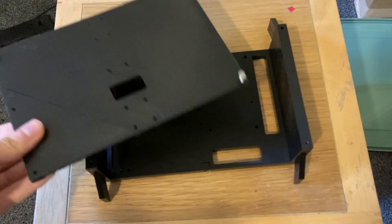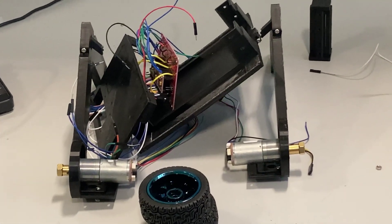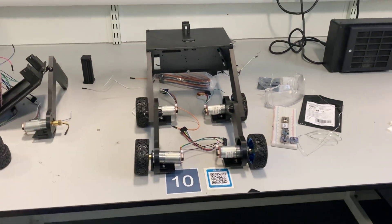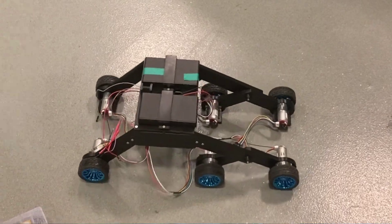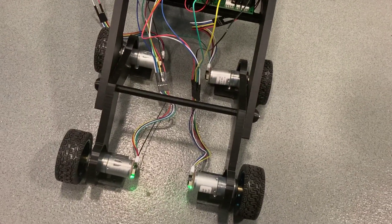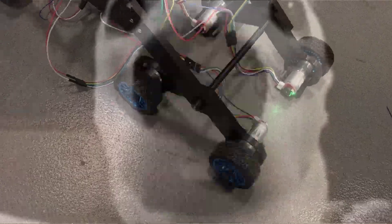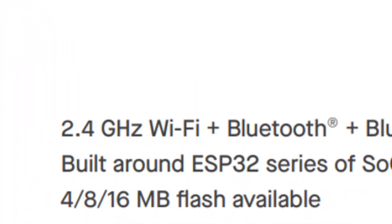During this microcontroller transition, I've designed and manufactured the second, and probably final, prototype design for the rover. It's longer, and whereas the initial prototype couldn't really turn at all, this one can, albeit with quite a lot of vibration. I tried to fix this vibration by adding a supporting beam, but it just made it worse. Our ESP32 is pretty similar to an Arduino, apart from it's got some additional Wi-Fi and Bluetooth functionality, which might be useful for our Raspberry Pi-based control system later.